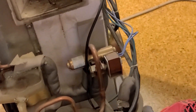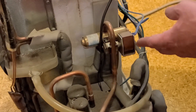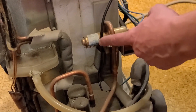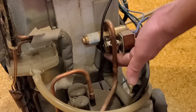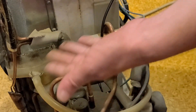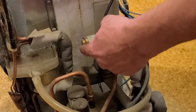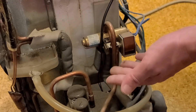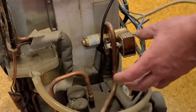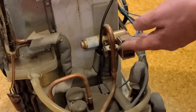This part right here is what they're charging the extra hundred dollars or more for on heat pump air conditioners — it is literally this special solenoid-controlled valve. There's a tube here, another tube here, and three tubes going into the bottom because it's a double-action valve that switches the evaporator with the condenser and reverses them. This valve has to switch four tubes — two pairs with each other — so it is a pretty complicated valve, and the expense of manufacturing is probably why they charge so much. That switching valve is literally the magic.